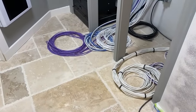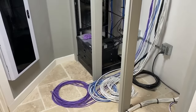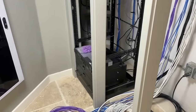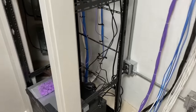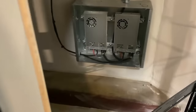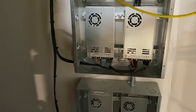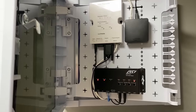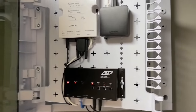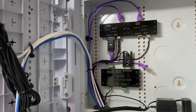And we'll zip over here to the equipment room, so you can see some 12 gauge wire, some of the control wire. You can kind of see the layout of our equipment racks. The middle rack there is for house audio. And these are our Meanwell transformers, power supplies for the low voltage system. Audio control rack 2 has an RTI PCM4 that runs the serial connections to the Epic Links, which are our star ceiling controllers.